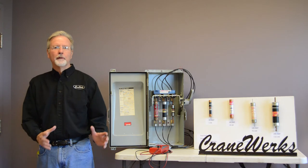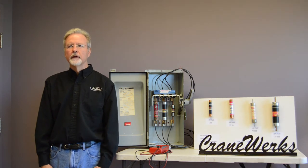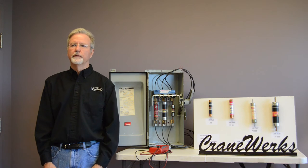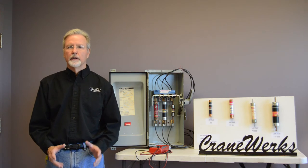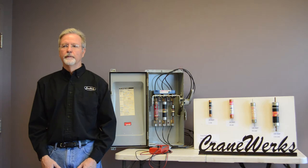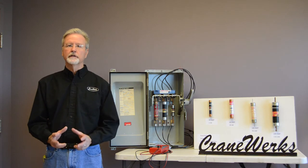All right, well, thank you, Professor Gary, for your help today. In summary, Gary trained us today on the different fuse types and their construction, proper ways to test fuses, and what causes a fuse to blow. Most important thing, though, is that we've been taught about the cardinal rule, and that is that fuses never blow or fail on their own. Some event had to occur that created where an overcurrent was present that caused a fuse to blow.